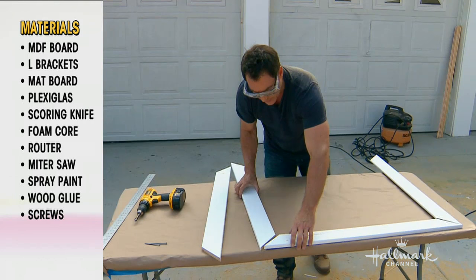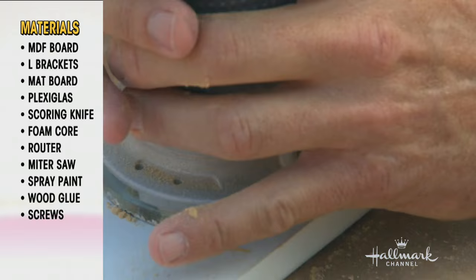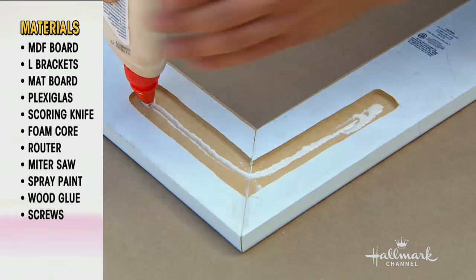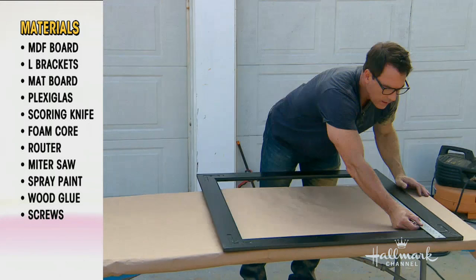Exactly the same — that's a very good idea. So here we are, it's coming together. How easy is this so far? By the way, the boards were nothing. So a little corner squares — here's a tip: I don't want those corner pieces to scratch my wall, so I use the router to route it out. I want them flush. So we did this, add a little glue and screw them in. Once they get screwed in, we add a little paint on top. I like to do things top to bottom. I'll paint the back as well, and I used a satin finish.